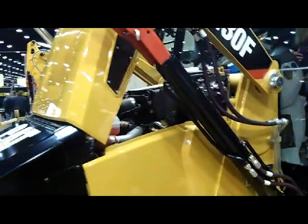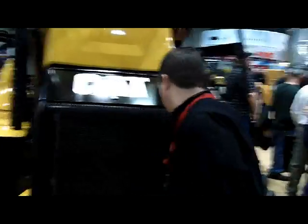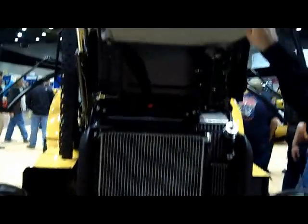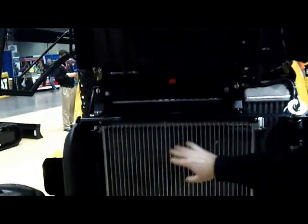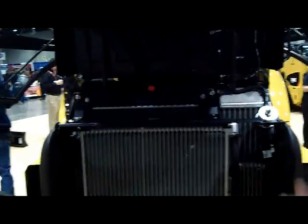You mentioned Tier 4 technology being included in this tractor. Can you tell us more about that and about CAT's strategy as far as Tier 4 is concerned? For our Tier 4 interim, we had to narrow the nose of the machine. We brought our cooling package up to the front, so that gives us more serviceability. We've changed it so we don't need any additional tooling to get into the engine. We just loosen these two bolts here. We can raise that cooling package up. This is your air conditioning condenser. Here in the front, we have our hydraulic and our transmission cooler. We do those side by side, so we get more surface area, and that allows us to get better cooling capacity and more efficiency for the machine.